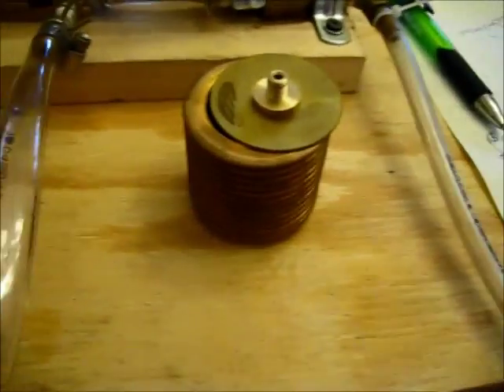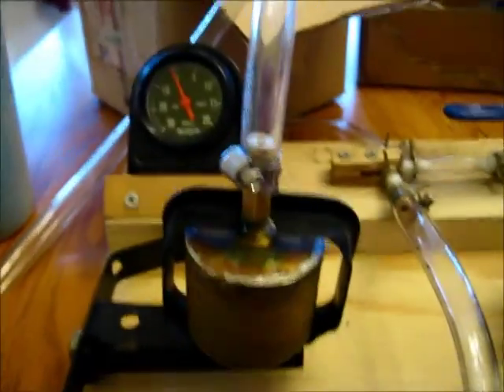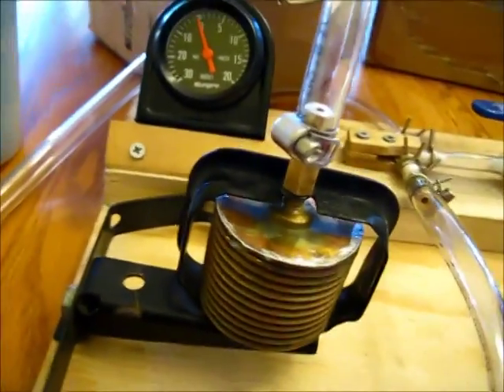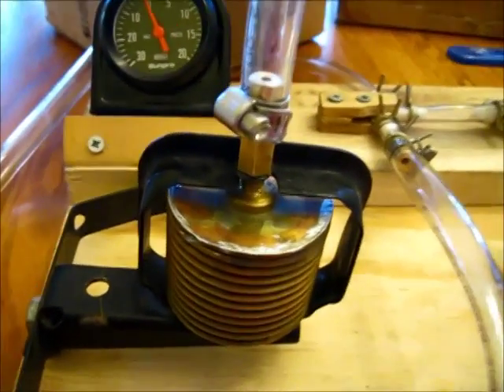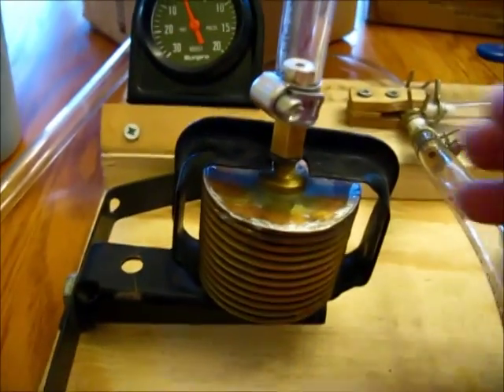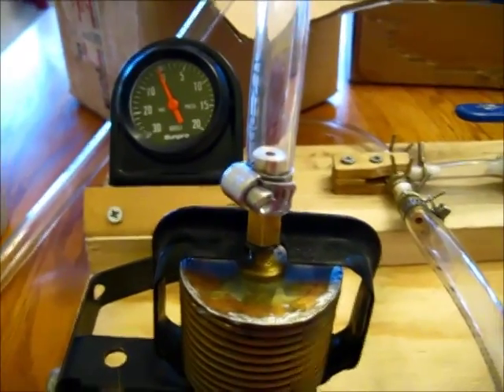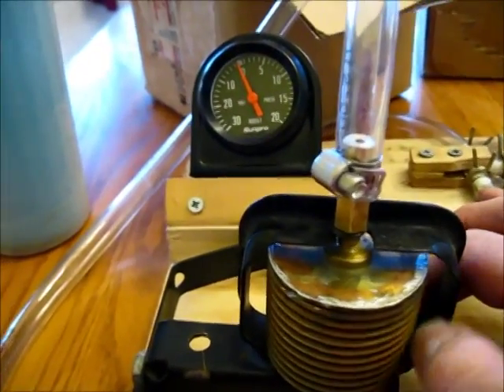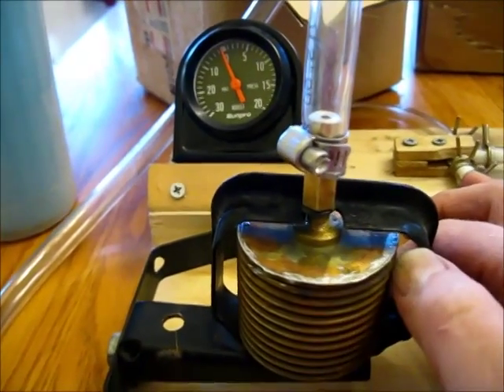What I want to know is when you have a thermostat with charge on it, what's going on inside. In this case, I wanted to see what the pressure is versus the height. The thermostat bracket is 47 millimeters of available height inside.